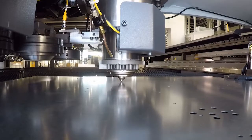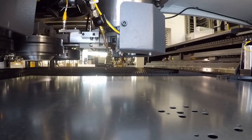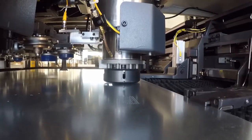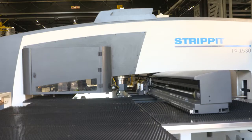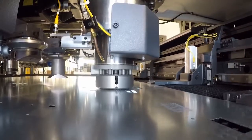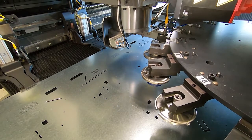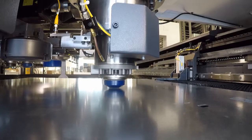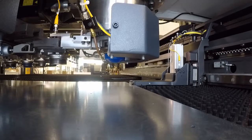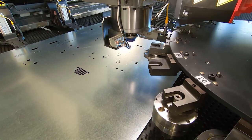Scribing is one of the special applications, with some others shown later in this demo. Highlights of the 360 degree punching head: precise and highly accurate process for optimal production due to a long tooling guide and tolerance against traverse forces. Low maintenance cost due to a wear-free hydraulic system and modern 2-circuit hydraulic for energy saving. Punching slugs are removed directly through vacuum suction so that no snagging is possible. This speeds up punch stroke to 950 hits per minute. All tools are freely rotatable.